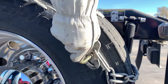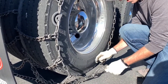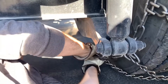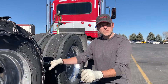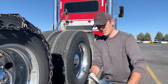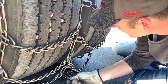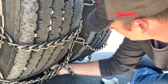This position right here is loose, and if we turn it counterclockwise, that's tight. When you're looking at the ends of the chains, you've got your hook end and you've got your chain end. I'm not going to put this on very tight — I'm just going to grab one or two links because you want some slack there, since you're going to have to go back around and hook up the other end as well. We're not going to go super tight, just two or three links in and we're going to call that hooked. Now we're going to hook the middle chain. This is where your fifth wheel puller will come in handy. We're going to go around back and use that to hook the chain, pull it through, and then hook it again — two or three links in, just get it hooked. I thread my fifth wheel puller through here and keep tension on that. Just hook it as best you can on whatever link you can grab.